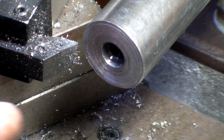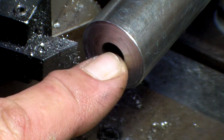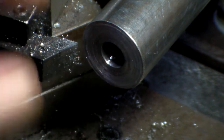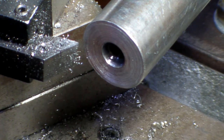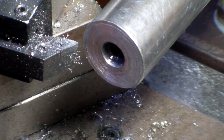Gingery has you boring out to 5/8", out to a 5/8" hole an inch deep, and then you use 5/8" shank cutters, or if it's smaller than that you make up annular spacers to make up the difference.